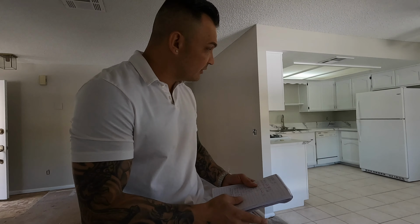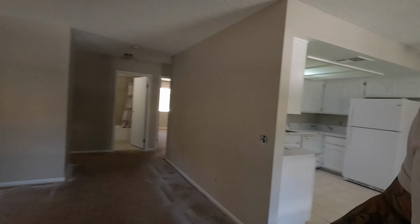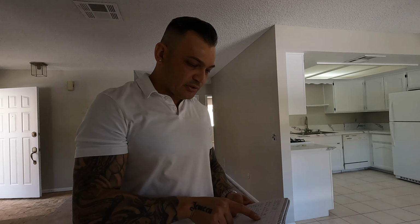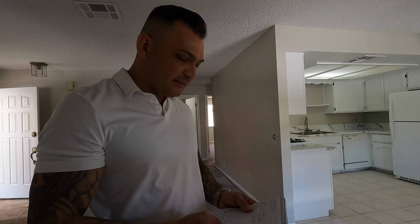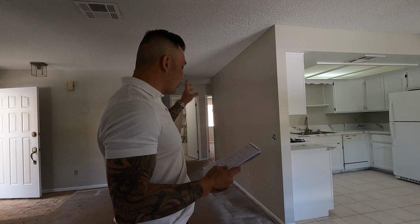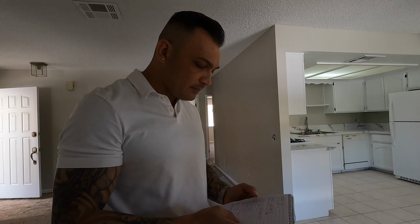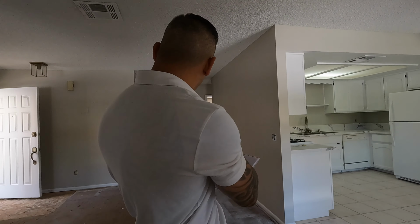We're gonna replace all the outlets. So I started at one end from the kitchen and I literally walked along the wall all the way around, right? 23 outlets, then I need one GFI, rocker switches. We need a total of 7 rocker switches. Now there's a double rocker switch, so we got a total of 5 of that. Ceiling fans, we got 2 ceiling fans, one for each room, but because it only has 1 rocker switch, we know that we need a ceiling fan that has a remote to control the lights. We need a light fixture for the kitchen, a light fixture for the entryway here.